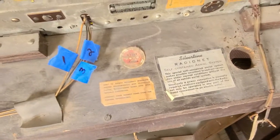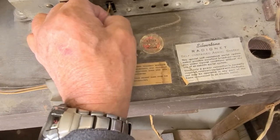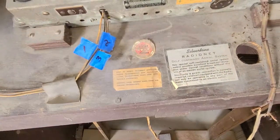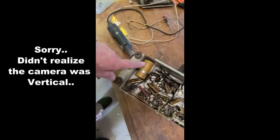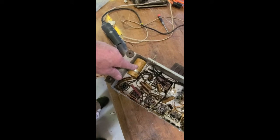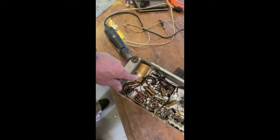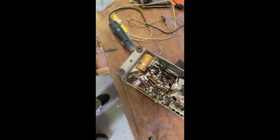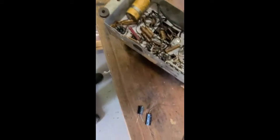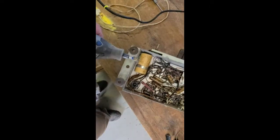I just numbered the wires for the antenna. I better get my needle-nose so I don't pull these out. Let me get this thing apart and we'll look at it. The first thing I'm going to do is change these two capacitors and then try it. I'll bet anything that this is the problem right here — there are two capacitors in there, they're 30s, and I just happen to have some of those.